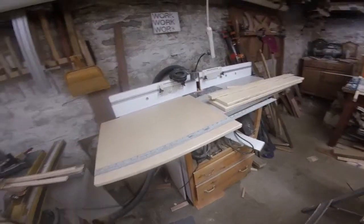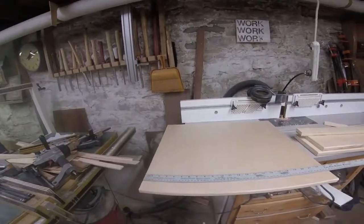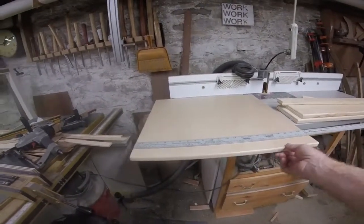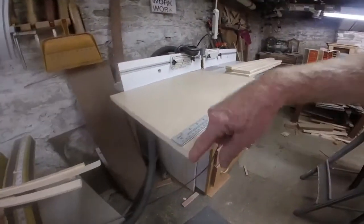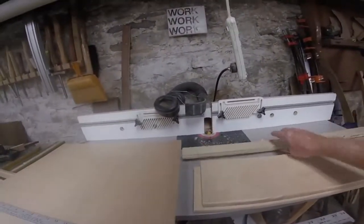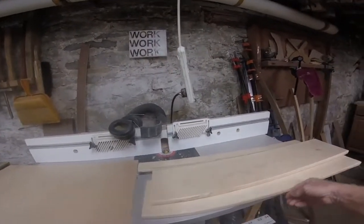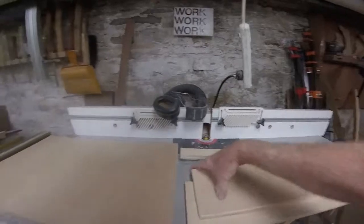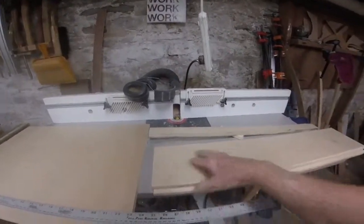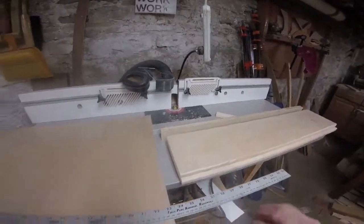Okay, walking around, I'll show you what the cabinet is comprised of. This will be the bottom shelf, and it's already been treated with a piece of wood in the front to hide the plywood. These are the two back supports, which you'll see. Again, these are banded with wood. You don't have to band the inside because that will be against the sides. This will be a little toe kick that goes in the bottom.